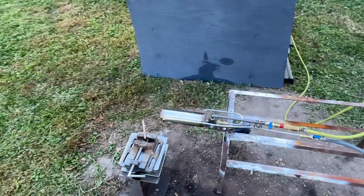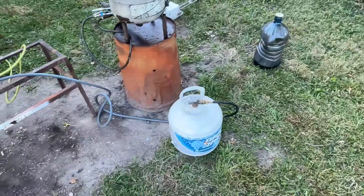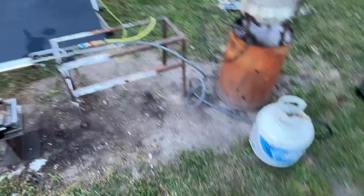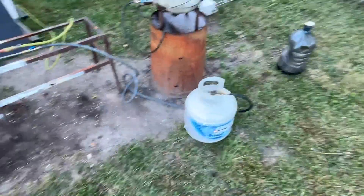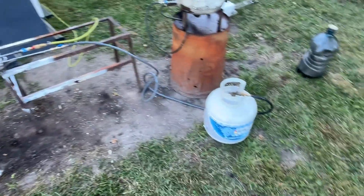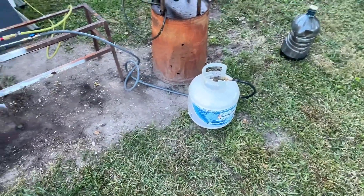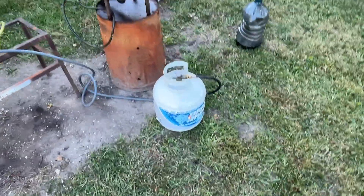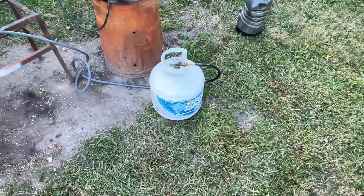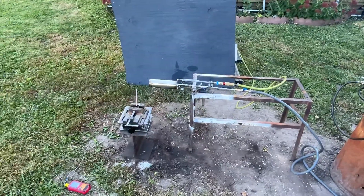Some kind of turbulence is happening in here causing an inconsistent airflow. I might consider doing something about that on a future build for a stabler flame. We're on a propane tank, and one of the problems is you're limited to about 90 kilowatts for about two minutes before power drops off drastically — the bottle starts to boil and pressure falls off the cliff. Ideally we'd run on liquid propane or several bottles.